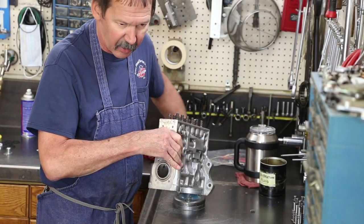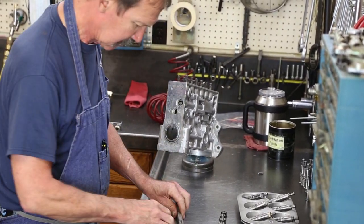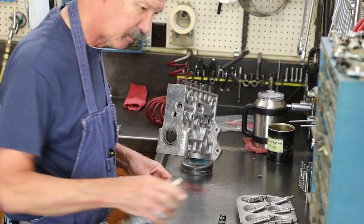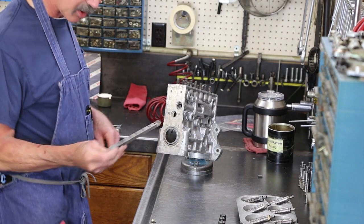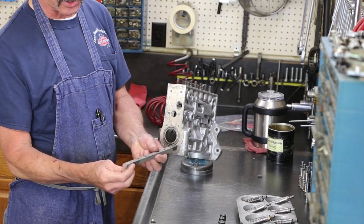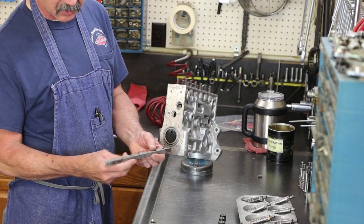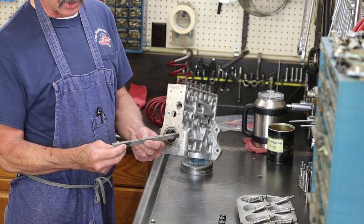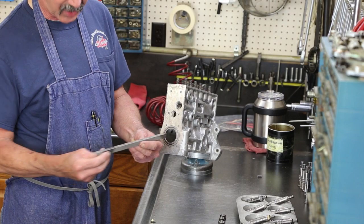Okay, I'm going to install the control rack. Links the governor to the pump elements. To operate correctly when it's all said and done, this control rack linking the governor to the pump has to be completely free. Any kind of stiction, any kind of holdups, governor's going to want to throw it into a fueling position. It's not going to want to go. It's going to want to stick in the fueling position, not want to come back when the governor wants to pull it back. And it's going to have a constant back and forth surge.